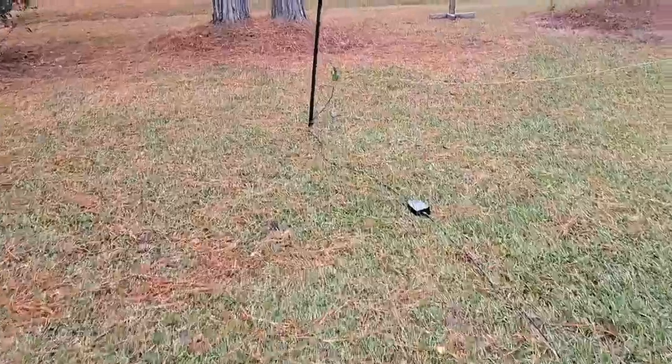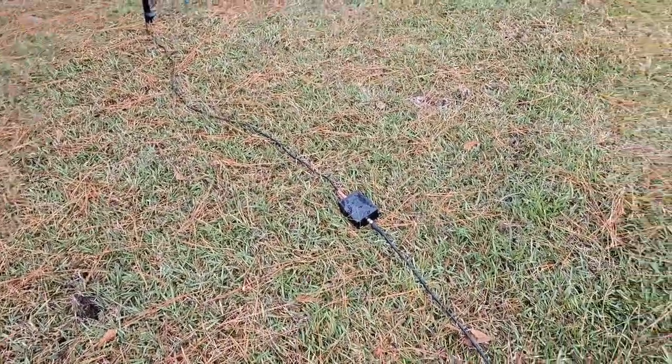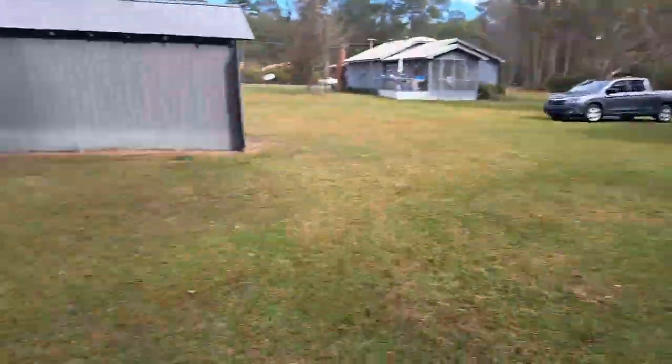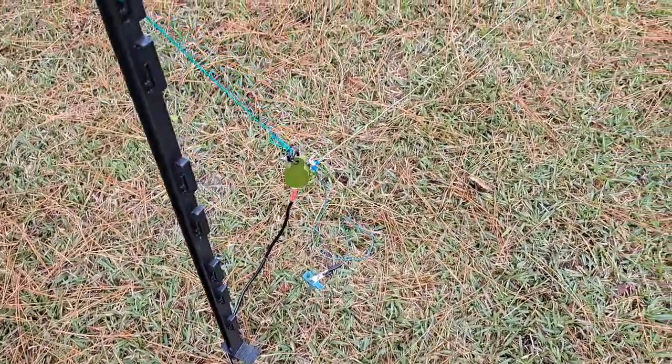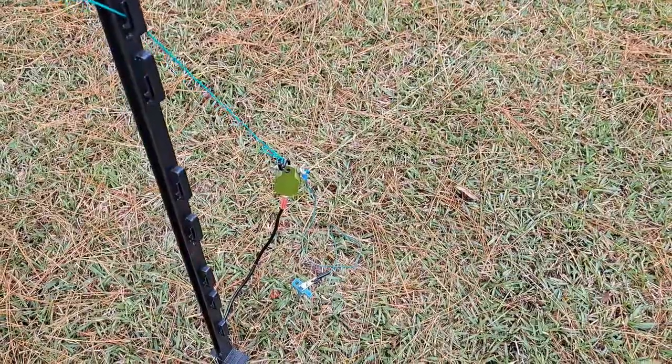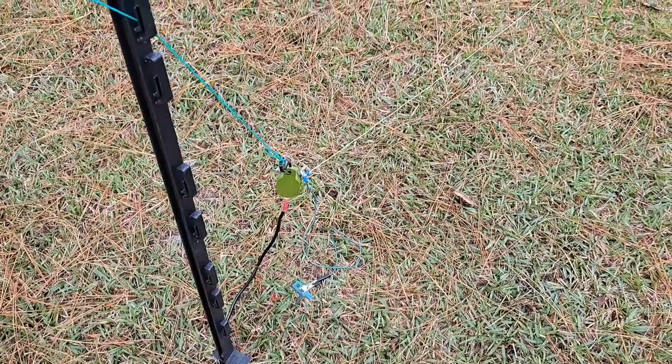So here's the end-fed half wave I've got set up at the in-laws. There's a choke that I made. There goes the coax way over there. Here's an N9SAB 49-to-1 Unun. I inadvertently busted the ears off, so I took a file to it and made them smooth.